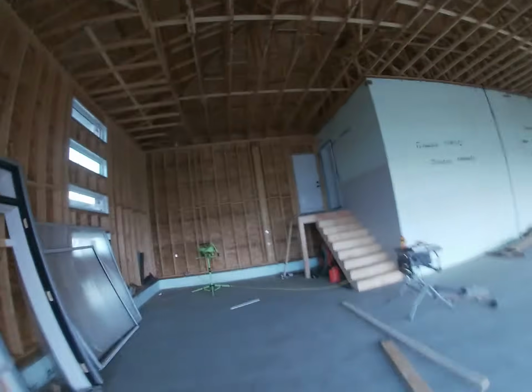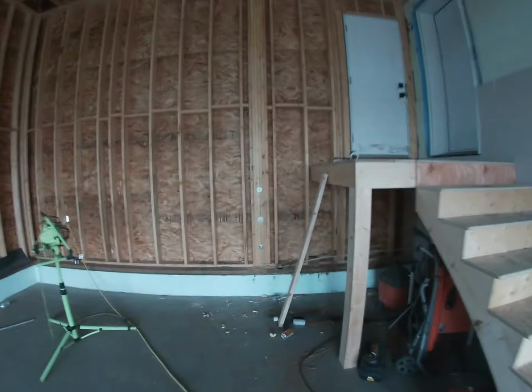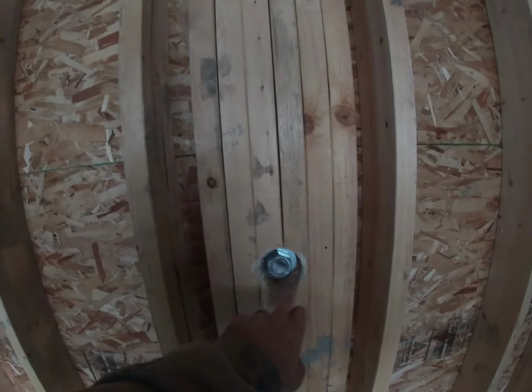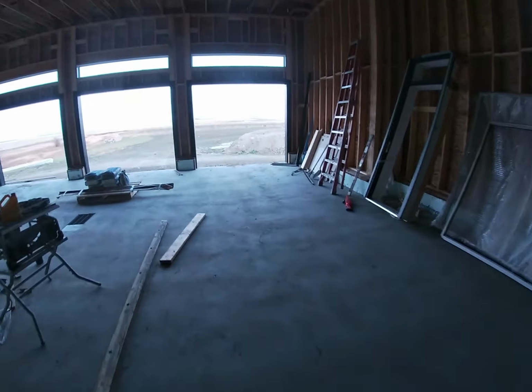It's not going to hold any weight there. It's just going to hold that wall from kind of leaning over if it ever gets any water or anything back in there and pushes on it. So on the other side here is that big column that's supporting that roof beam there. So we've got this giant 2x6 mass here that we just kind of embedded those bolts into, and then we're going to block this all the way across there, and that'll turn this into one big solid whatever, you know, it'll be very, very strong. We'll block it back that way too. And those bolts, they won't bend, and they should resist any pressure that way. It would really have to push really hard for those to move, and I don't think that'll happen in there because it's all covered by a roof anyway, so we shouldn't get a lot of water back there.